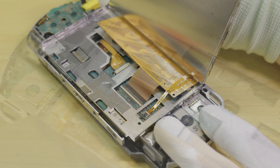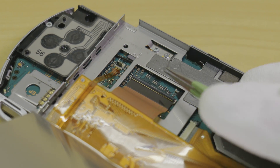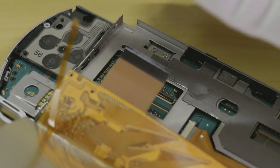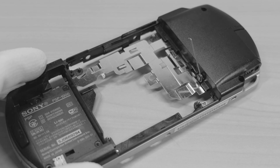With the display in a sturdy upright position, gently remove the display and backlight flex cables by carefully unfastening both of the FFC connectors like before. With the display removed, we can move forward to detaching the optical drive assembly.